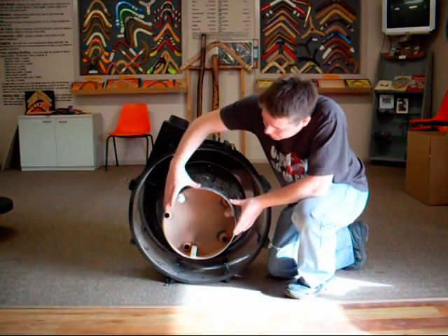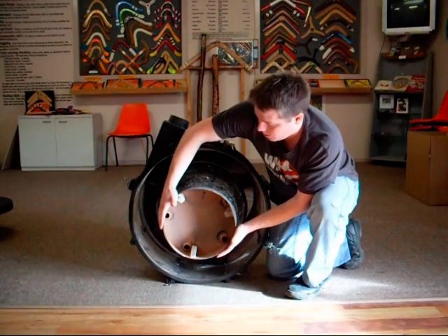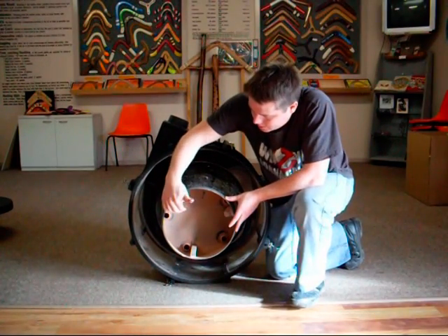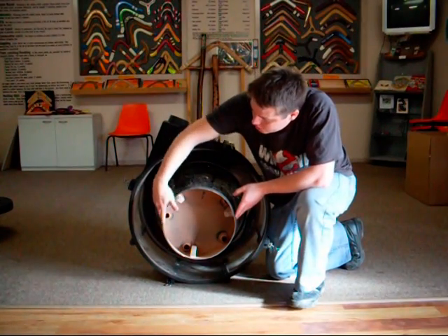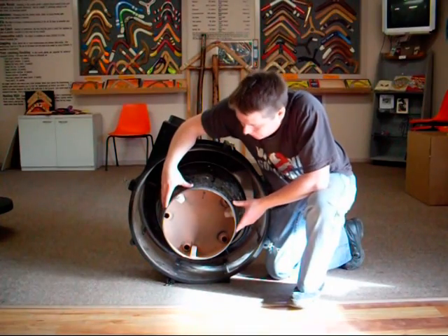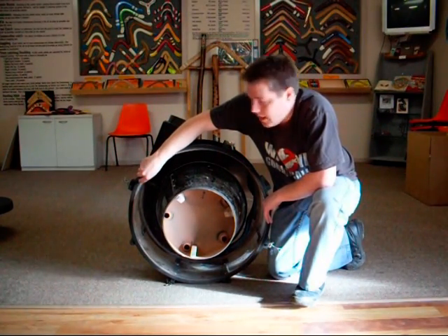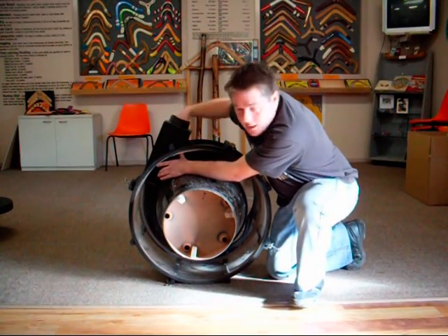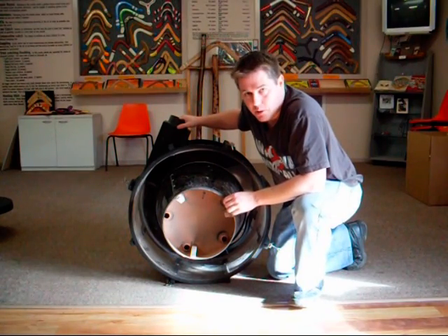Back to the cyclone body — at the bottom you've got five cones coming in. This shroud goes into the smaller bin inside the larger bin. This all needs to be sealed off so air doesn't get sucked up into the cyclones and stop them from working. I've got a neoprene strip along the outside to help seal it into the bin, and the outer cone tends to fit quite snugly anyway. I've also got a neoprene strip around the top of the larger bin. There's also an air ramp going around to make sure the air doesn't crash into itself as it enters the cyclone, and to help direct the flow of dust downward so it's deposited at the bottom of the outer bin.